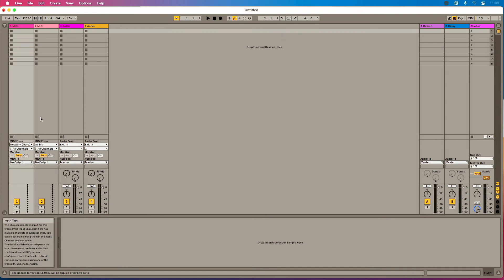The full signal path is: Nord sends five-pin MIDI to DIN1 on the Mio XM, then from DIN1 to RTP1, which connects to our computer and the network session, which then goes to Ableton Live. To send MIDI in reverse — from Ableton Live back out to the Nord — I'll set MIDI To on the track to 'Network Nord.' That's the recommended way to make an RTP connection between your X-Series interface and your computer. It's automatic and saves permanently.